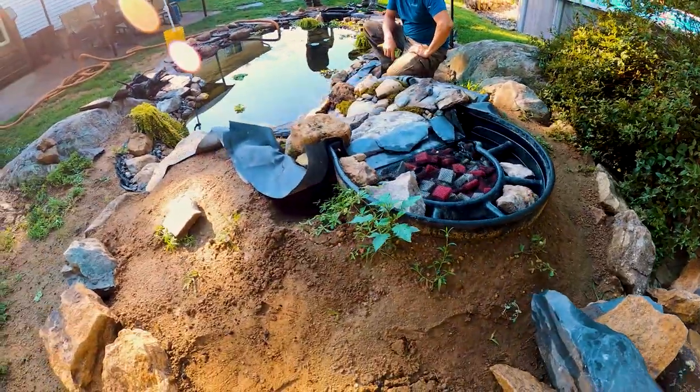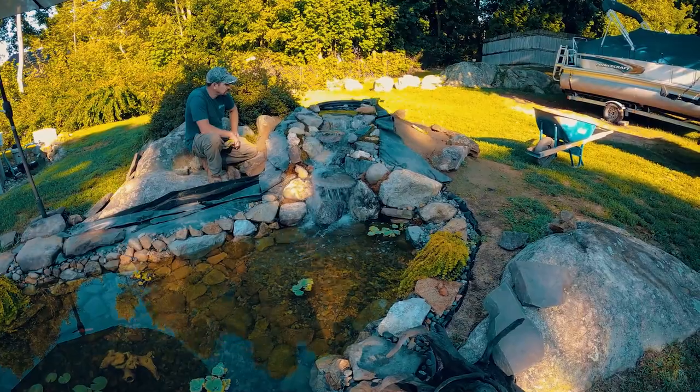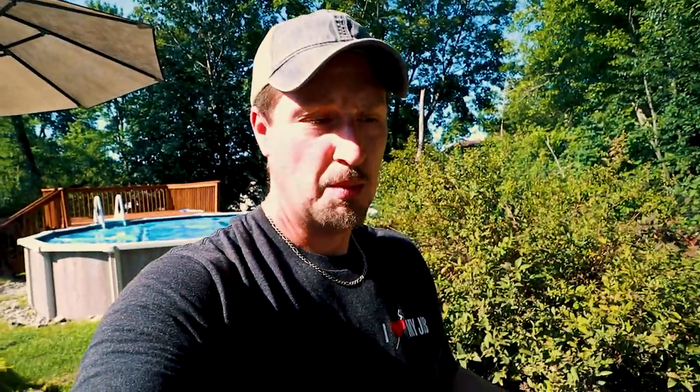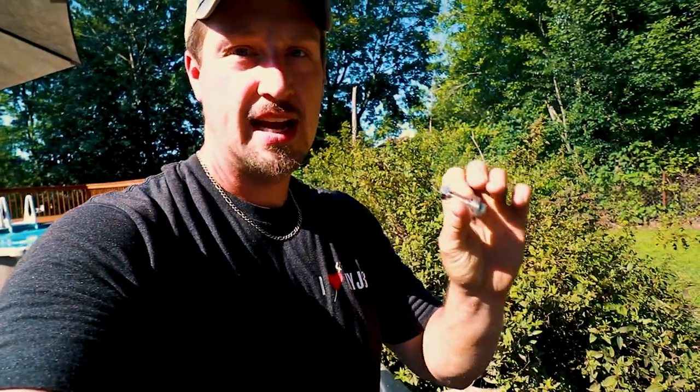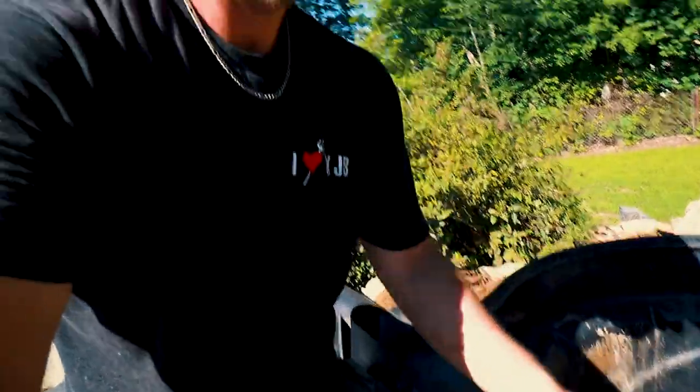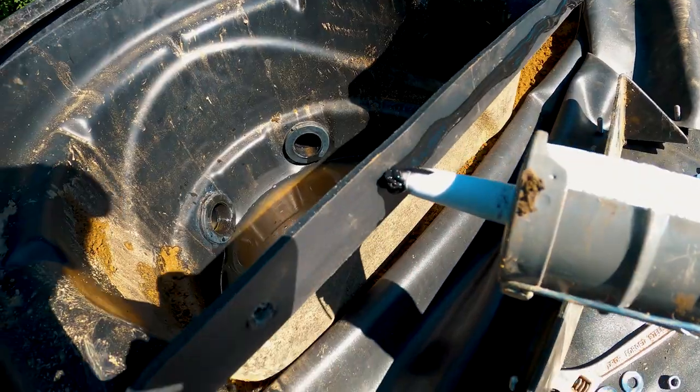This is the fourth fix to get this waterfall to not leak. In all of those fixes, taking the bolts on and off from the biofalls, the factory screw holes fell out. The customer did what we as Aquascape contractors sometimes need to do — on the older molded plastic biofalls and skimmers, the hardware rots out. So they've actually replaced all the hardware with stainless steel washers, bolts, and nuts, and drilled out the holes a little bigger to allow these bolts to go through. We're going to reuse the stainless steel hardware — there was nothing wrong with it, it's not going to rust or deteriorate like the older stuff. So I'm going to put a thick bead of silicone around the edge of the lip here, then reattach the lip using the stainless steel hardware.